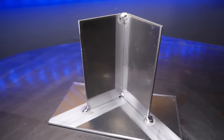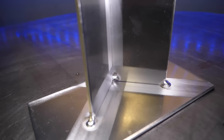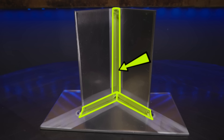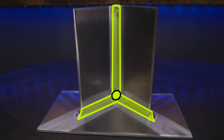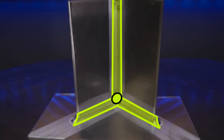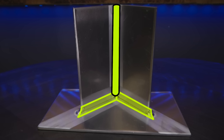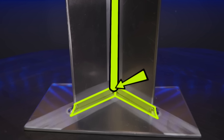The first and most important thing is to consider welding directions. Given that we have a few passes to consider, which way do we want to point them? A basic rule: I don't want any buttons or starts in dumb places. For example, if you do the two flat welds perfectly but do the vertical one last, it leaves a button right in the middle, messing up the nice work you've done. Or if you start right in the corner, you have a random start covering up the nice flow. We do not want this.